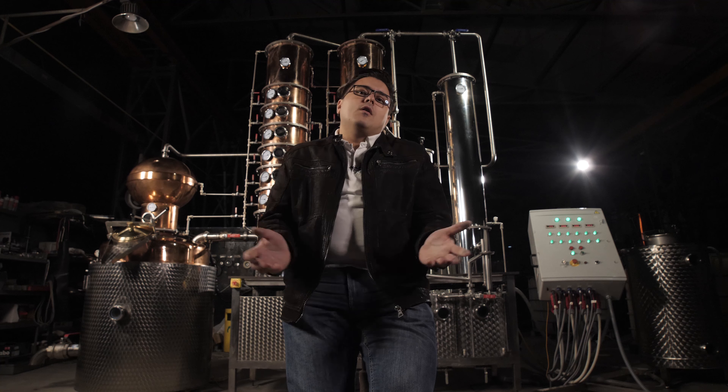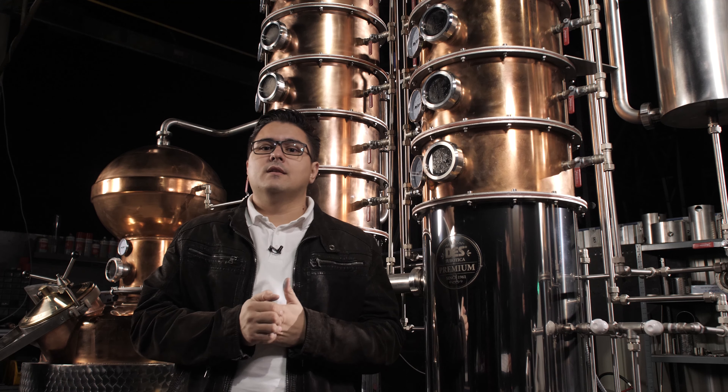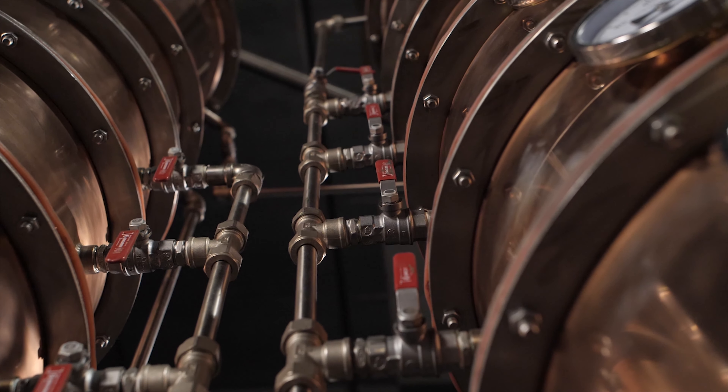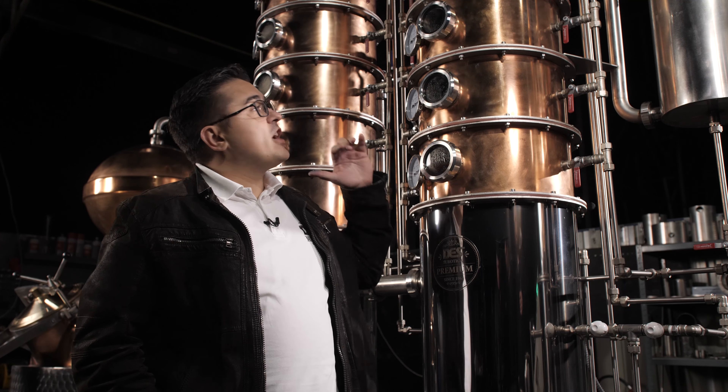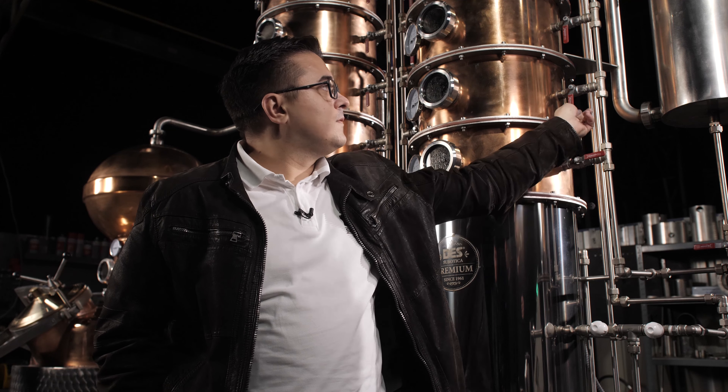This process is very important in the production of quality spirits. Once extracted, the vapors start passing through one or two columns that are specially made for beverages like rum or gin, and they are designed to preserve the smell and taste while achieving maximum smoothness. This smoothness is achieved by free contact of vapor and reflux. Condensed liquid coming from the dephlegmator passes down through 10 bubble plates, so this process is repeated 10 times — or fewer, depending on the kind of spirit you're making. The spirit comes out with the same characteristics as a traditional setup, only in half the time.